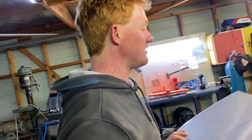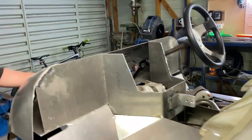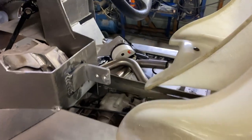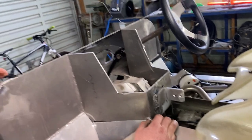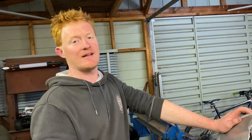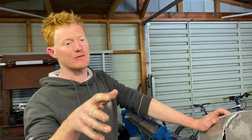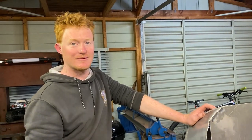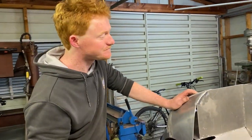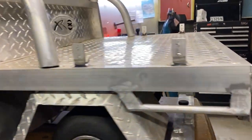It's fully auto and runs back through a little gearbox from one of those little Chinese buggies, so we've got forward, neutral, and reverse. I'll build it like that so I can teach them to back the little boat trailer I built — teach the kids and put a handbrake on the back. Forward, neutral, reverse through that little motor through the gearbox, all chain drive down through the back.